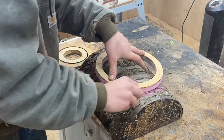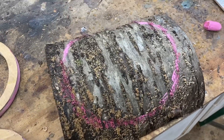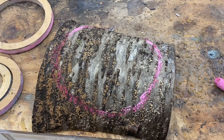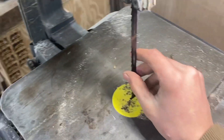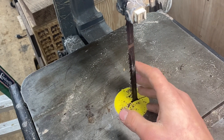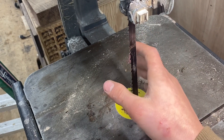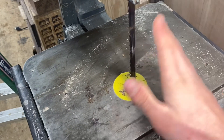Make it really dark so that it's easy to see on the bandsaw. Now we've got a nice big pink circle that's a lot easier to see than something like Sharpie or pencil — we're going to have very good visibility on the bandsaw. I like to use a half-inch blade for cutting out all my bowl blanks. I find anything thinner than a half inch tends to wander a little bit more than I want it to. I'll put the TPI down in the description.